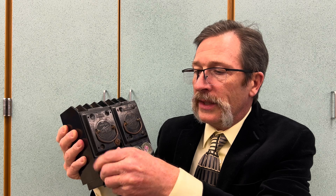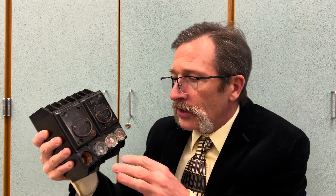On houses we used ones that would screw into what looked like a light bulb socket. A piece of metal goes right across the top of this glass — you can look in and see if it's blown, and this one happens to be blown. The problem is you could accidentally stick your finger in here and complete the circuit, which would be terrible. You screw a new one in and the lights on the house come back on — or maybe the fuse blows again because the short circuit is still present.